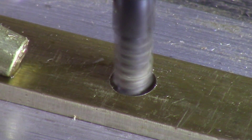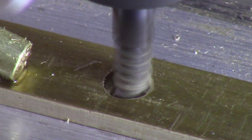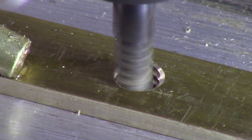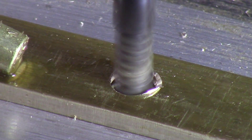This part of the video is shot in real time — this is not sped up. So this is the actual time to cut these threads. The actual time to cut this thread, which is 20 threads per inch and a quarter inch deep, is around 40 seconds.